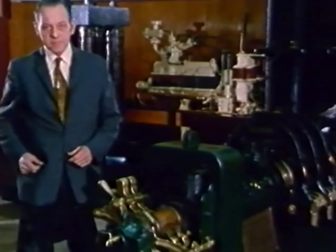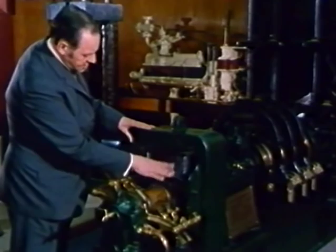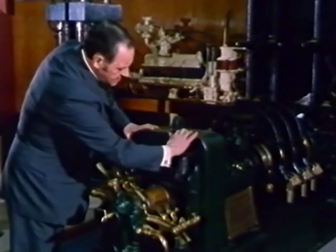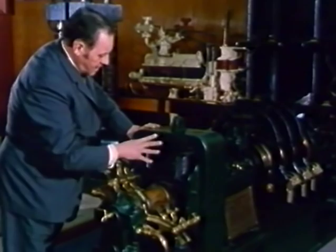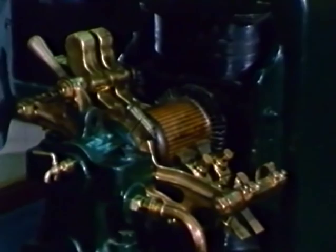If you forget all the top structure and concentrate on the business end, then the idea of having a pole at one side and an opposite pole at the other is not very different from the shape which 20 years later was to become the parent of the modern machine. This generator of 1900 has a short pole at the top and a pole underneath, and the magnetic flux is returned by an all-embracing magnetic circuit around the outside. As soon as they'd done that, they realised they could add more poles and make a rectangle become a circle.